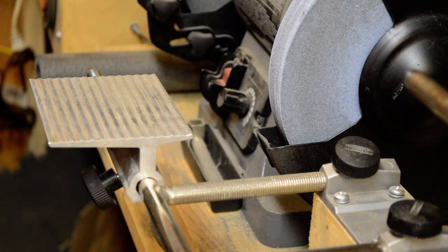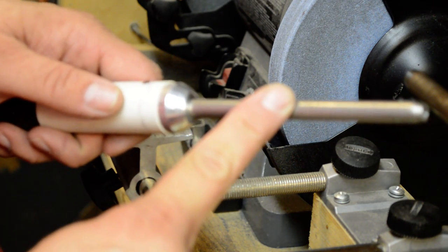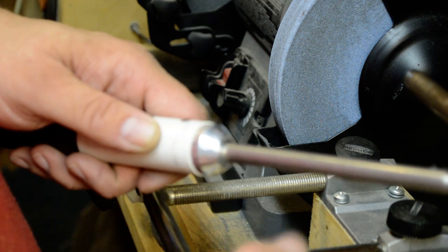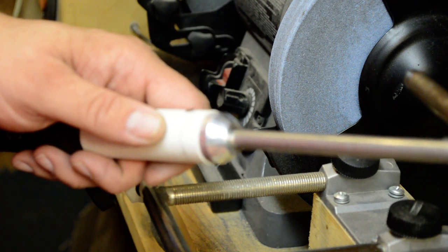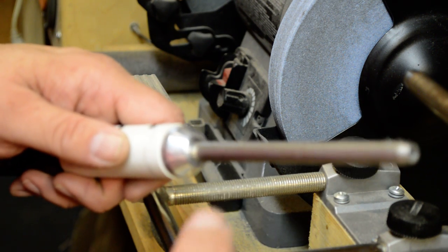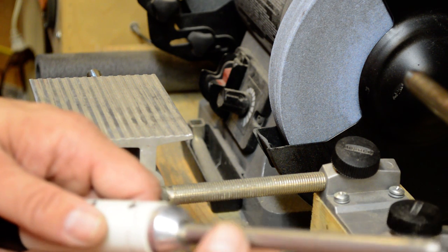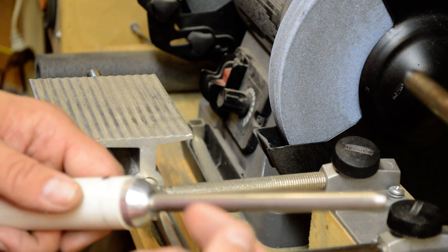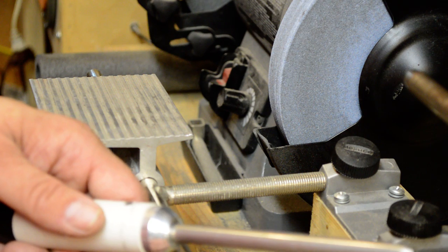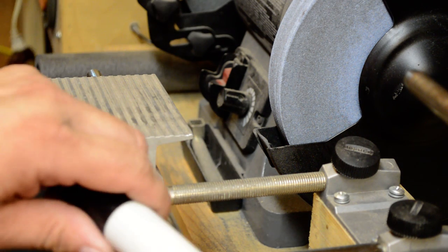One thing I forgot to mention: my tool shafts are 1018 cold rolled steel round bar, and the inserts are 6061 aluminum. I get it from onlinemetals.com. You don't have to get exotic steels unless you're dangling way over the tool rest, which nobody recommends anyway. I haven't had a shaft bend even doing deep hollowing. It's a couple of bucks a foot for three-eighths. Buy more than five feet and UPS charges an upcharge, so buy in quantity — save money, make lots of tools. Tool handles: PVC is cheap, aluminum is pretty cheap.